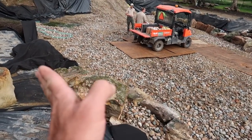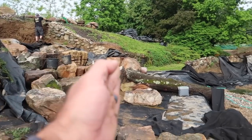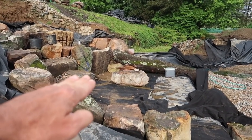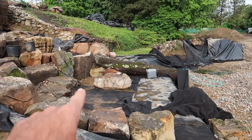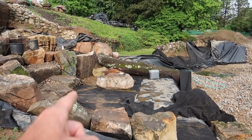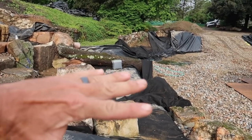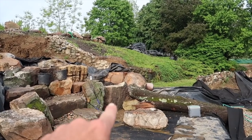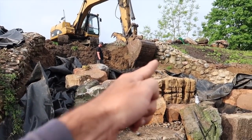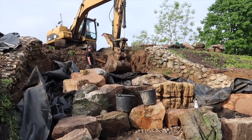The original pond was coming up right over here — this was going to be the boundary. What I decided to do was create a deep water ledge right in here. So instead of having the waterfall pushed way out, we dug into this and the pond level goes through this little shallow area. All those waterfalls are going to come down and create a really good push of water. When you have a waterfall that dumps down into a deep section of water — 18 or 24 inches deep — you just get a lot of turbulence right at the base. Because this is only six to eight inches deep, the water comes down and tries to escape itself outward as quickly as possible, creating a big push of water going in this direction. We're creating all these different layers and drops. We have two existing walls they want to protect because of the history, so we're working systematically up from the bottom.